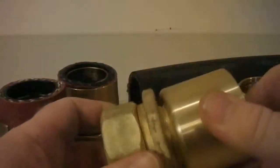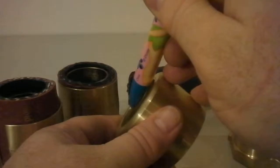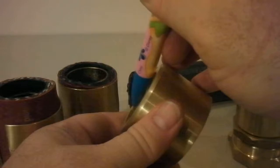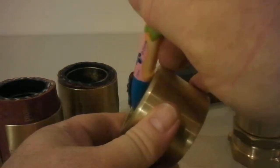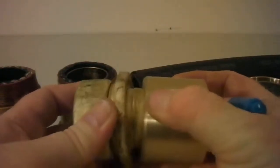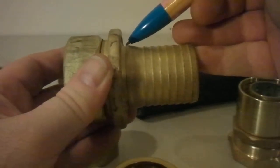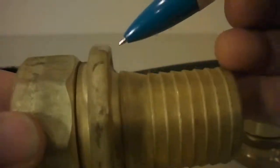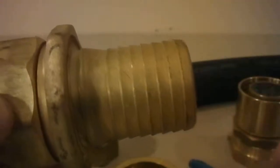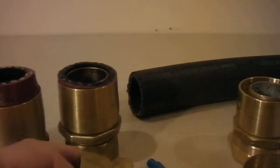So what I think is happening — if you look at this fitting here, there's a collar on it right here. This little piece, hopefully you can see that — I'm using my little handy dandy Tinkerbell pen. The width of this collar looks to be about an eighth of an inch approximately, and that's supposed to lock into this fitting. But you can see it doesn't lock in; I can't get it to sit on that little ledge.